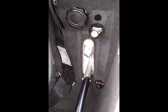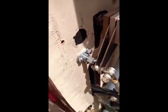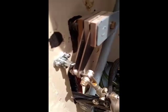You can see this. This is a collective down lock. In the cockpit, there's a knob accessible to the pilot. A quarter turn on the knob, and this little clip will spring retract when I push down on the collective. See that? Retract it, and now you have free motion on your collective. To downlock it again, I just turn this knob to the detent, and when I push the collective back down, the pin has spring loaded back out,